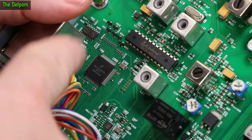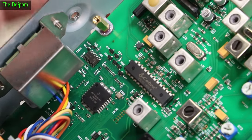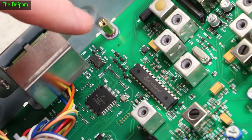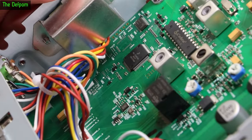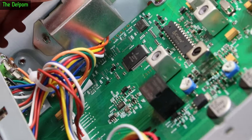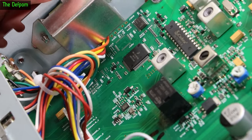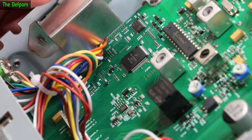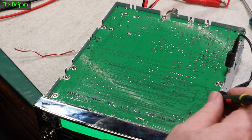I've also got this U600 sitting over here — I might have a look and see if I can find 5 volts on there, because that would be a convenient spot. If I can find 5 volts in this area, I'll just run a little short wire. There's also a header over there, J302 — maybe there's 5 volts over there. I'll have a look at that. When we find 5 volts on that header, that'd be good — I'd run a wire from there instead. I'm going to check that now by powering it up.